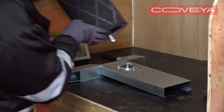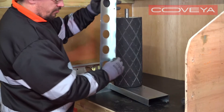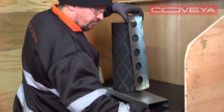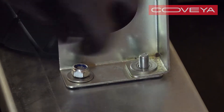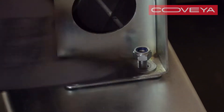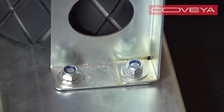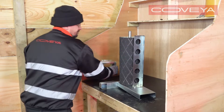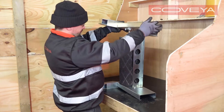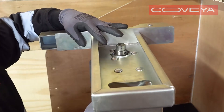Place the middle cross member as shown. The side with five holes in must be next to the drum. Make sure the top surface is aligned towards the top of the plate. Secure the cross member to the plate using two M8 by 20 cap head bolts. Lift the right-hand side plate onto the drum, making sure the holes are aligned. Secure the cross member to the plate using two M8 by 20 cap head bolts.